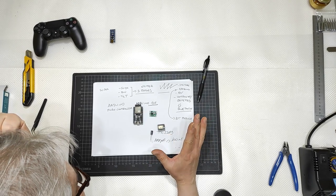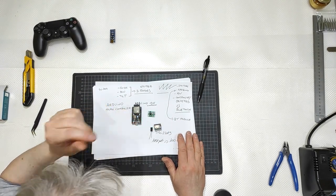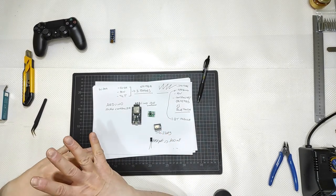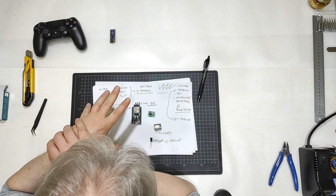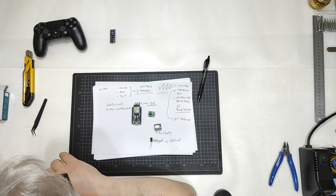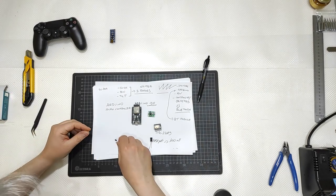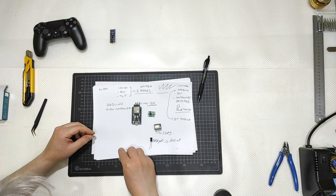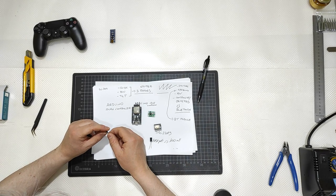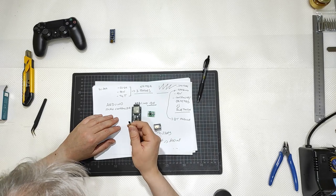Then, as the adapter, obviously, but this system is intended to work with some Hall effect system, okay? A Hall sensor is like this one. It is similar to a transistor, okay? But it's a Hall effect sensor. So it can sense magnets. It can sense magnetic fields.